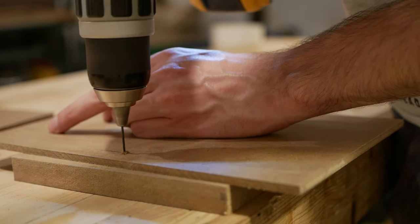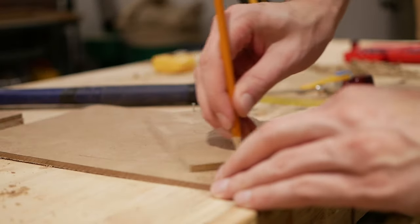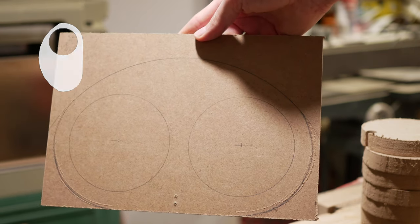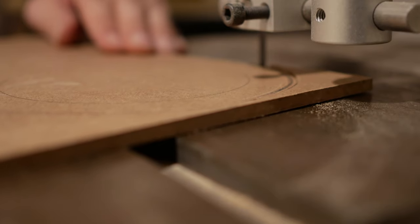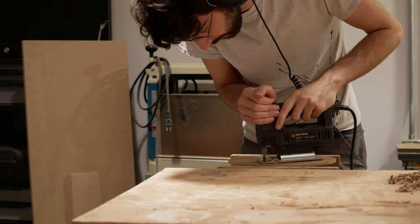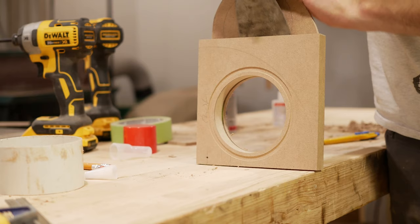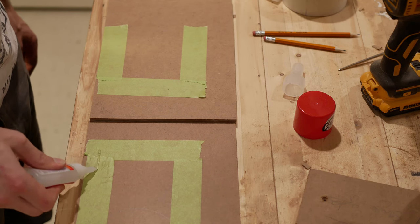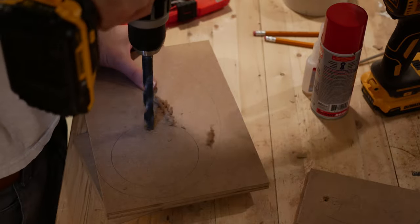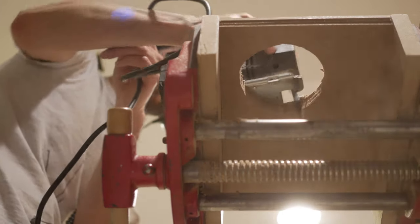Next I'll start to work on the gate itself by drilling a hole where the motor will mount at the pivot point and use that with a compass to mark the layout. I roughly cut it out on the bandsaw and sanded down to my line at the edge sander. Then I roughed out the opening, flush trimmed it with the side I used before, and could stick the rest together, rough them out, and flush them up with the first gate I made.